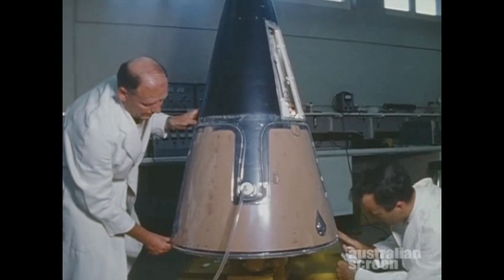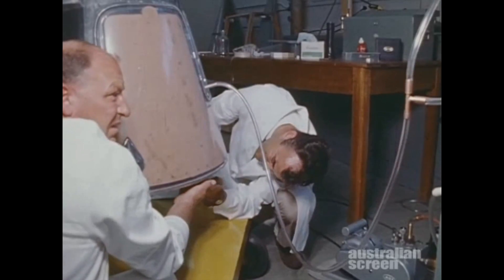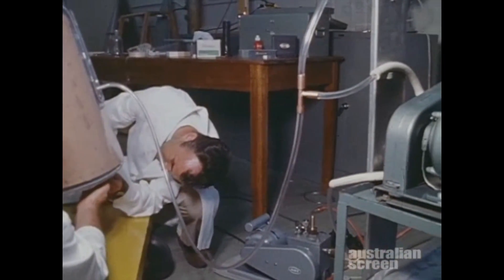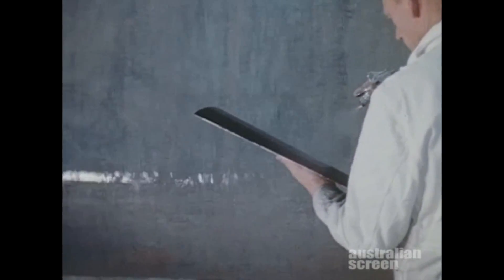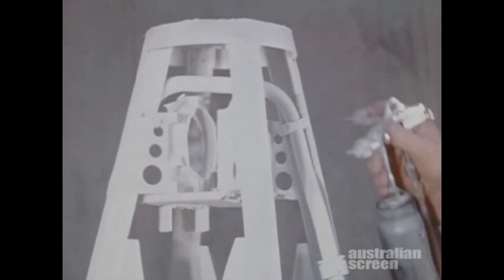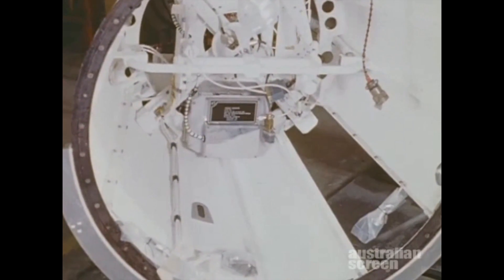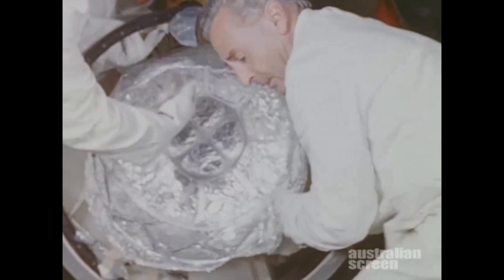A number of precautions were taken to protect the cone and its contents from extremes of heat and cold. As a protection against aerodynamic heating during launch, one eighth-inch sheet cork painted black was fixed to the surface of the cone where protrusions occurred. The remaining surface was also painted black so that a suitable balance would be achieved in orbit between heat absorption and emission. Internally, the cone was painted white to promote uniformity of temperature, and a shroud of aluminium foil and glass cloth was placed over the third stage motor to shield the interior of the cone and instrumentation from its heat.